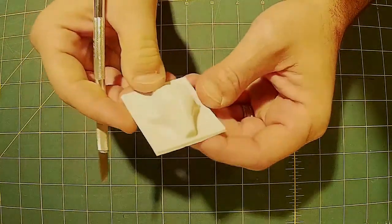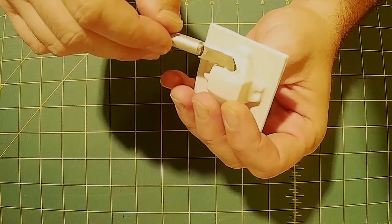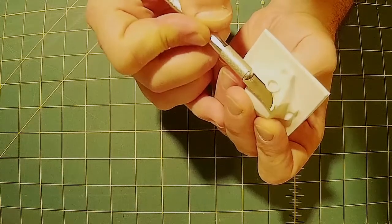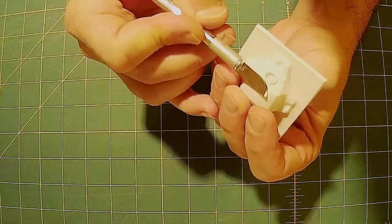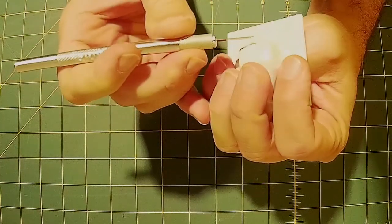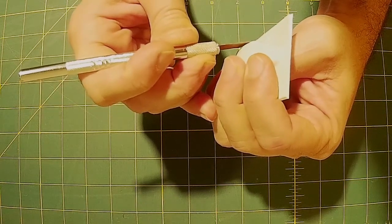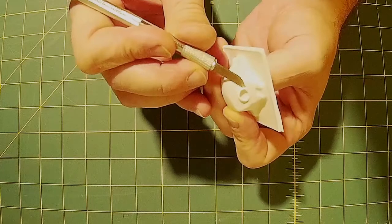That should do it. Then come to the front, and you're just going to come straight down and slice the original camera mount right out of this. So the mounting style for this is going to be just like the original Tiny Whoop mullet mod. I'm just going to make a hole big enough to squeeze the lens through. We're going to put a little piece of double-sided tape on the flight control board, and it's going to be solid as a rock.